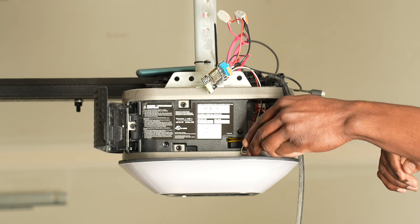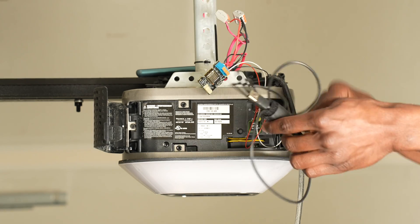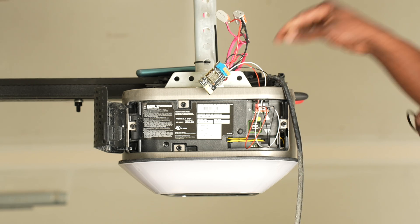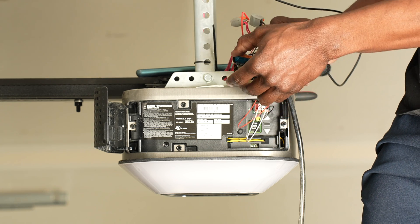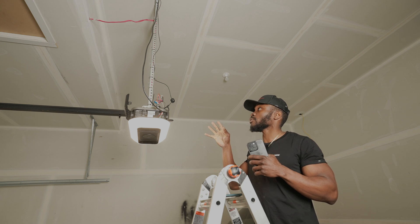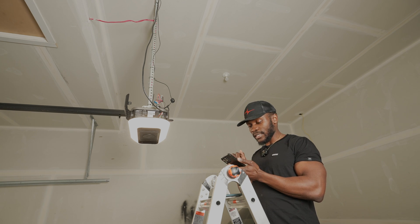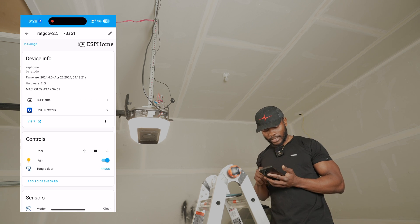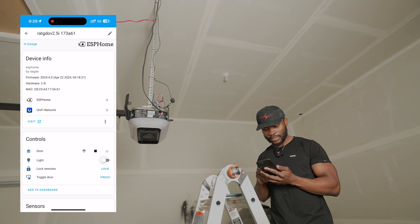Next is testing to make sure everything is good. I'll use a longer USB cable since the one provided isn't long enough for my tall garage to reach the power cord. Plugging it in — now it's the moment of truth. Everything is powered up, the board is connected and lit. I head over to Home Assistant, go to devices, find my ESP Home device, and can see the light entity. I toggle it off — and it works. I can turn it back on again.